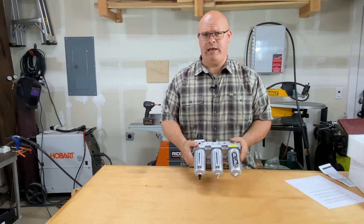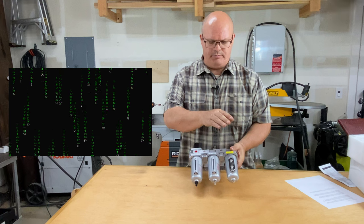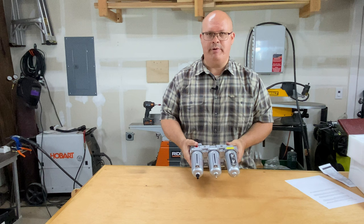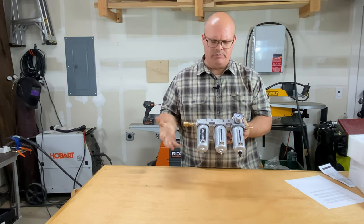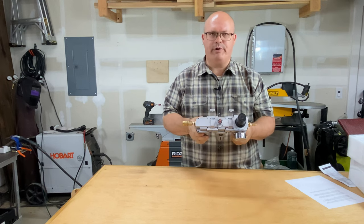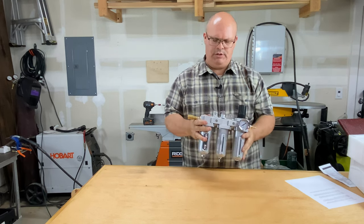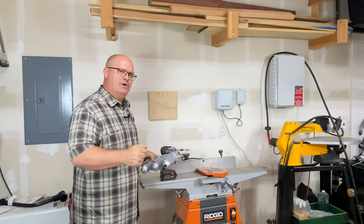Off camera I will be rearranging the system — I'm going to put the regulator on my left, your right, and the desiccant filter on the other side to match the setup of my shop. Stay tuned. As you can see, I have my intake and my outtake set correctly — the regulator is on this side and the desiccant on this side, with air flowing in the correct direction. I've mounted this on a piece of plywood on the wall so I can get all four screws into something solid.